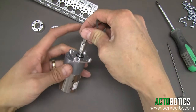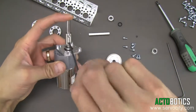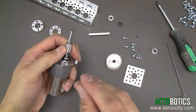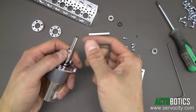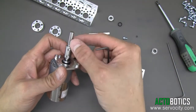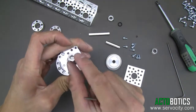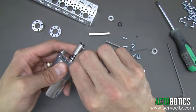Place that onto the gear motor, line up the flat on the shaft, and tighten that down as well. Then we're going to take the short shaft back out. The reason we do that is because, since the six millimeter is smaller in diameter than the quarter inch shaft, it allows us to get our depth exactly right when sliding that on. Double check that it's nice and tight.